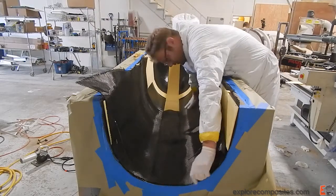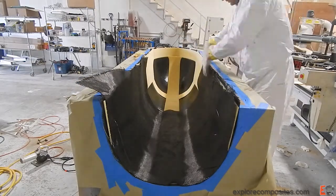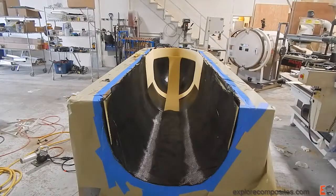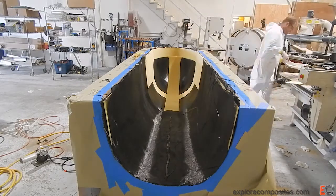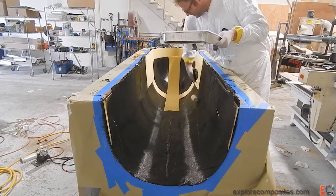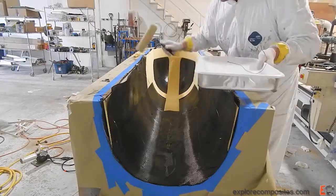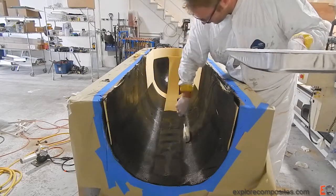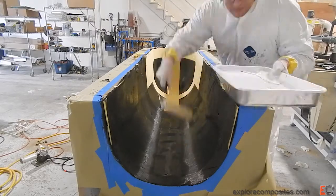Now the second skin is going in, just laying a full panel across the whole thing with no slip joints. Just going to let the crimp in the fabric and careful pushing down make it fit around the edges of the foam core. Again, this is a very minimal amount of resin — hopefully it'll be enough, and hopefully the bleed stack doesn't pull off too much and we get dry spots. I have a pretty good sense of how much resin I want to be using and I'm just eyeballing it in terms of the wet out.